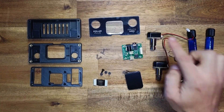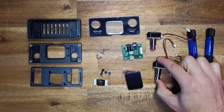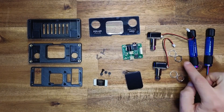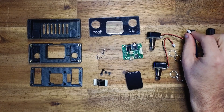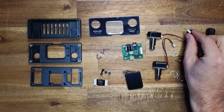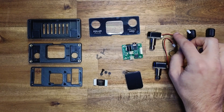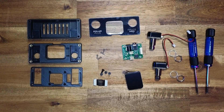You'll need two foot switches — we recommend these ones, they're extremely common in many guitar builds and are a momentary switch. You will need the nut and washer fastening for those, as well as a 2-pin JST PH connector. This is a 2mm pitch connector, which isn't always standard with these switches, so you may need to grab the wiring harnesses and solder those yourselves, as well as the allen keys to assemble them.